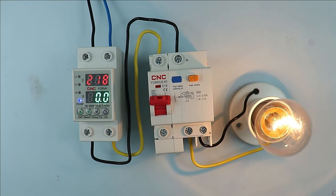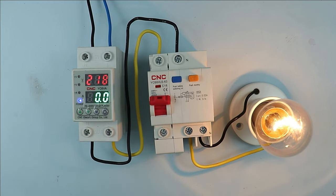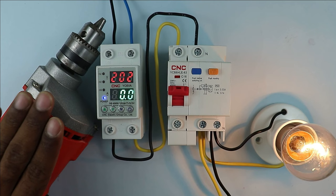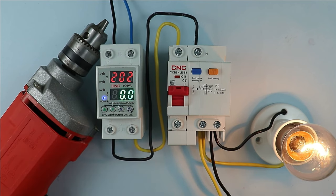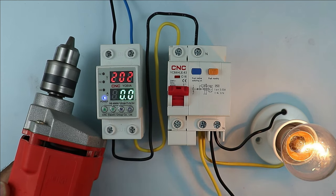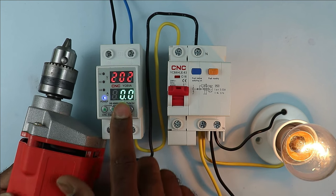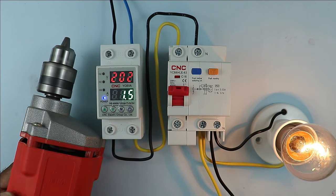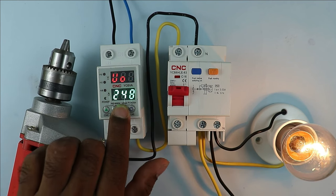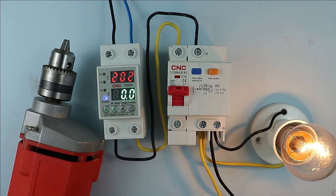So you got how this device provides protection from earth fault, overvoltage, and undervoltage. I told you I will also show you the current. So with the output terminals, I am connecting a heavy load — this drill machine is now also connected along with this lamp. When I turn on the drill machine, you will see current starts increasing. Right now the value of current is around 1.5A, and we programmed this before for 2A. So I will decrease the current rating — going to I0, changing this from 2A to 1A. Save this programming and come out.